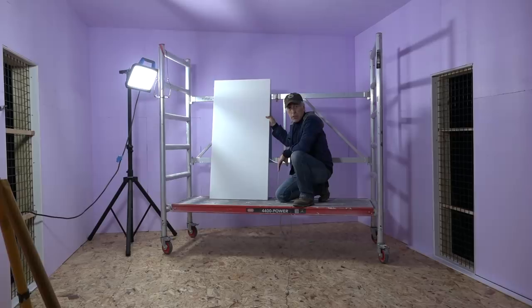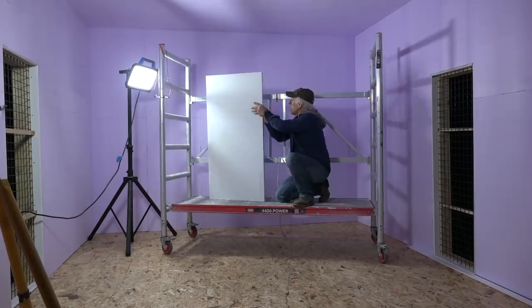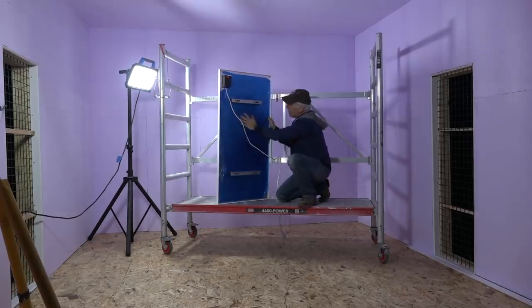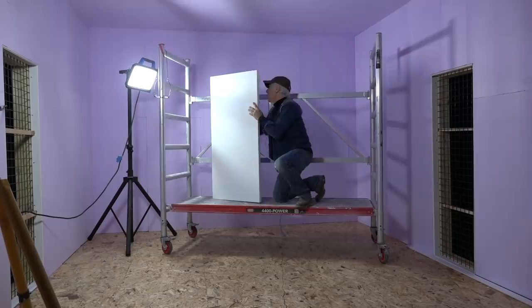I've gone for four panels totaling about 2,800 watts, which is more than enough for my paint booth of about 35 cubic meters — I've actually oversized by double. You can find wattage guidelines on the seller's website depending on your insulation. These panels are very safe: they are insulated all around, very thin, with no open flames or sparking areas possible — making them extremely suitable for a paint booth.